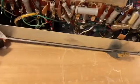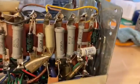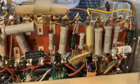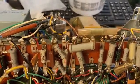The other electrolytic capacitors on the bottom are kind of hard to see, but these are Sprague capacitors — I believe there are four of them underneath here. There's also a couple more I forgot to do, like this one right here — it's a 1 UF, pretty small, so I'm not going to worry about it right now, but I may change them out next time I order capacitors. The big ones are the big power filtering capacitors that you really need to change; these others I would do while you're at it.